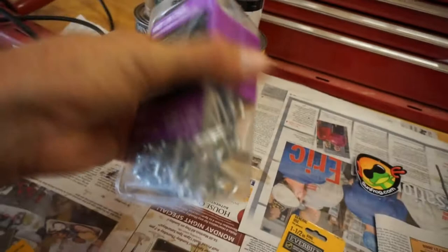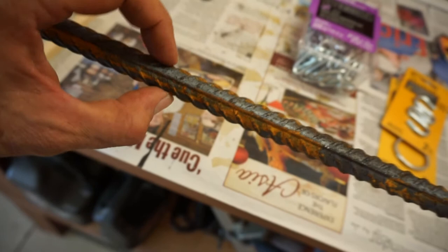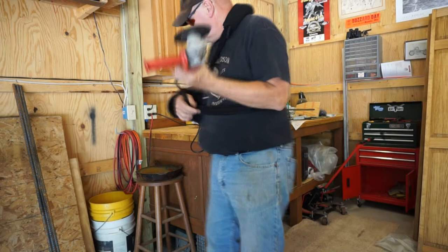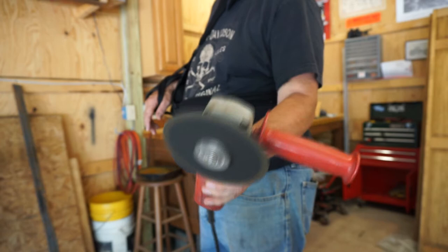I thought it was a pretty slick idea so I'm going to try to make one today - with one hand of course. The first thing I did is I went to the big orange home store and I bought these rings. I'm probably only going to use one of them and those will attach at the top. I got 15 foot of number 135 chain, some S hooks, and then this rebar - I believe it's half inch, the thicker stuff. It comes in 10-foot lengths so I'm going to have to do some cutting. I'm going to cut these to five-foot lengths so the legs will be five foot tall.